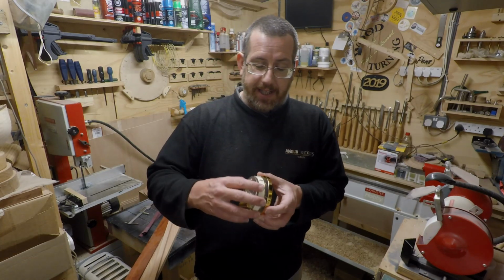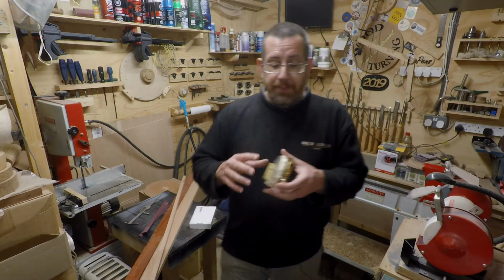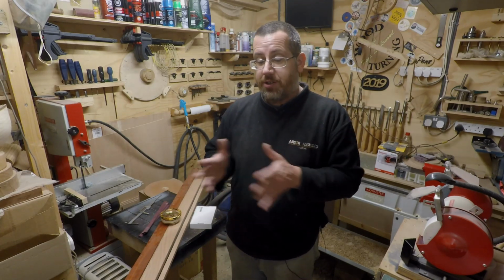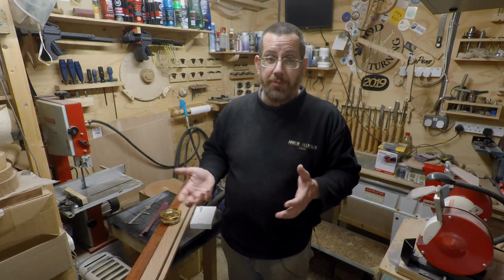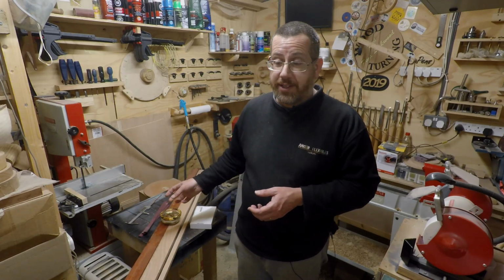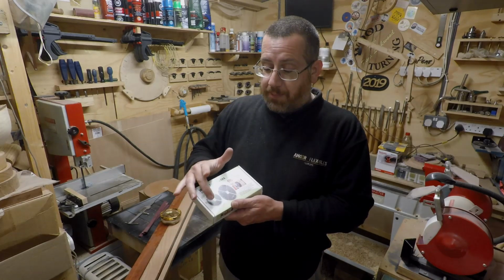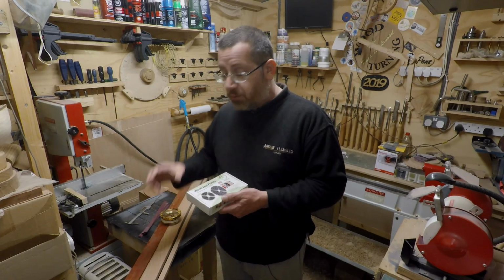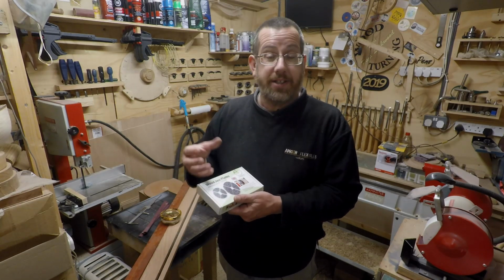Now, the good thing about this is that it has this rubber band on here with these teeth on, so it should go in nice and tightly. Now, my main problem here is that I need to do a 91mm opening on here. The jaws I've got, standard C jaws, really only want to go up to about 90mm maximum to hold inside, and the jaws are really stretched out, so you don't get a great hold. The next size up jaws I've got, the opening's got to be 100mm, and therefore it's going to be too big for this. A while ago I did buy these wood jaw plates from Axminster for my jaws as well. I will probably make up some form of a wood template on there that I can then use as some form of soft jaws, so that once I get the segmented ring made up, I can then grip it from inside securely and safely, and it doesn't mark all the inside.